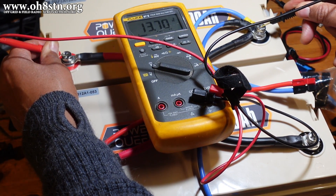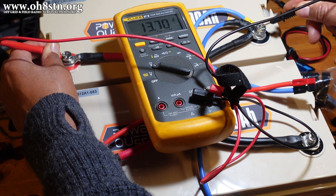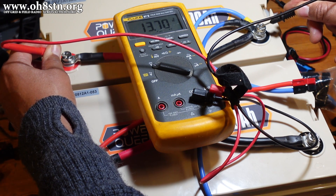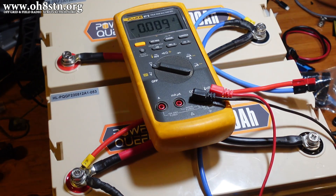Now when I connect the charge controllers from our solar panels, we'll be charging both batteries as if they are one integrated battery — 200 amp hours, 12.8 volts nominal voltage. It's that simple, guys.